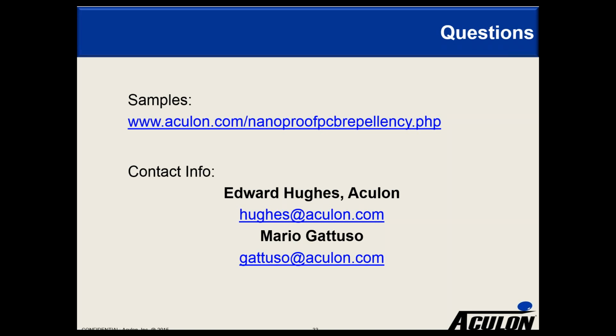Okay, thank you, Josh. Next question is, a very good question, can this product be applied over no clean flux? Oh yeah, that's an excellent one. This is Eric Hansen speaking. So the no clean flux, this is something we've run into in the past where people have applied our chemistry on top of boards that have had no clean flux used. A lot of times these no clean fluxes have essentially fatty acid compounds to react with the metal oxide, get it off there so that you can do a soldering. Problem is that stuff's left behind, and whereas it's not water soluble, it is solvent soluble to some degree, so people will see some whitening or essentially redistribution of that spent flux residue across the board. So we do recommend that even people using a no clean flux may need to do cleaning of that material, because once you start applying water and voltage, you've now got this sort of partially conductive residue still present, even if it's underneath our coating, which could cause some problems.